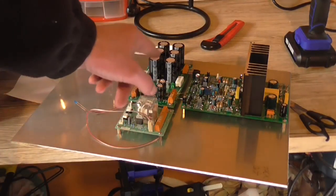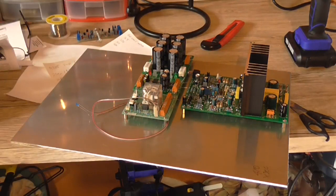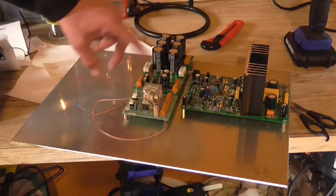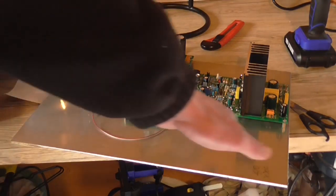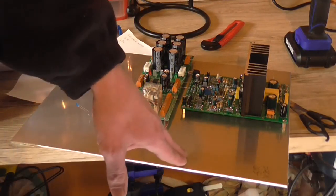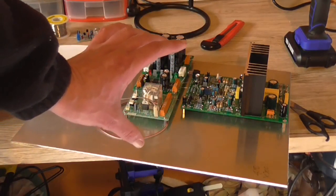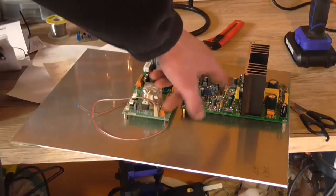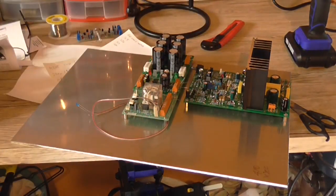There's another little smaller board with the volume control on it — that's also got to have clearance to this relay. For all intents and purposes, this power supply board can go right up the back, well out of the way. There's still room here for a large toroidal transformer, a smaller toroidal transformer for the ±15 volt rail, a bridge rectifier for the high side, and an earth point — still plenty of clearance for the pre-amplification stuff. The volume board will be sitting in the middle of the front panel; it's a 3U high case, 120mm high, so it'll be somewhere around the 60mm mark. Mounting it in this orientation is about the only way I'm going to solve the issue.